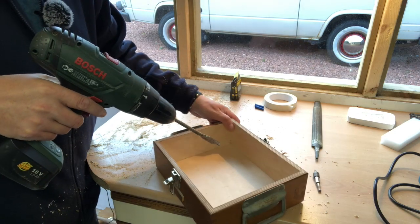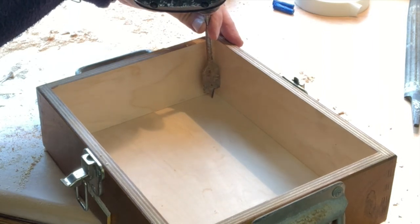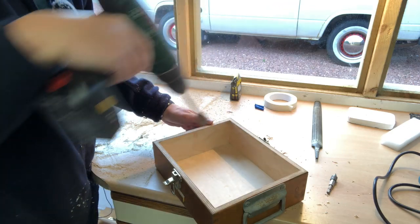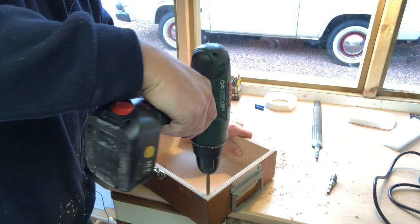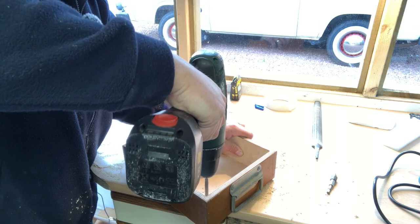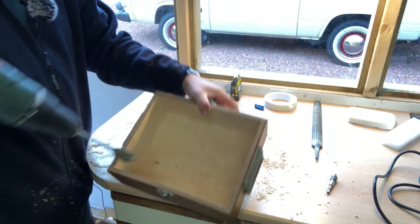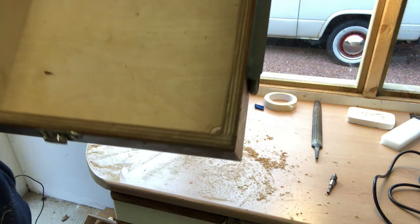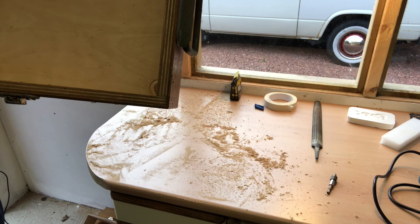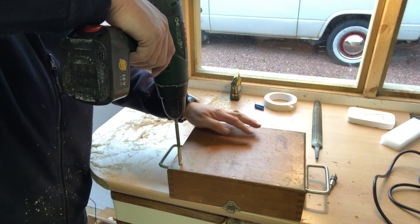I'm going to use a spade bit in the corners. All I'm going to do is touch the blade to the wall on one side, try and match so I'm nice and even in the corner - touch it, yes, that's nicely positioned. Hang it over the edge. I'm going to make the first contact in the corner so that we can see the hole is in the right place. There's also a little pilot hole on the back - now drill from this side so I get a neat finish on both ends.